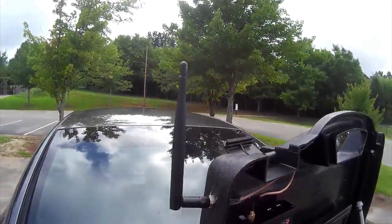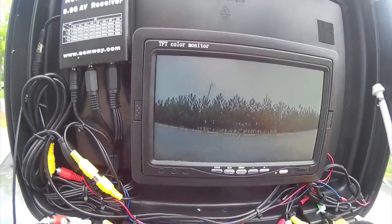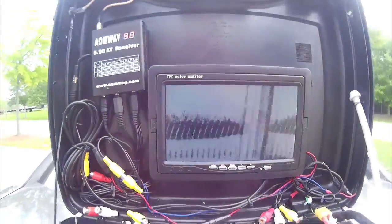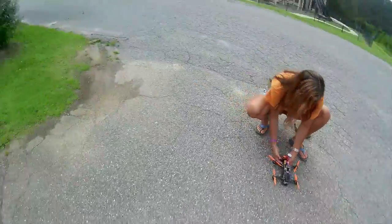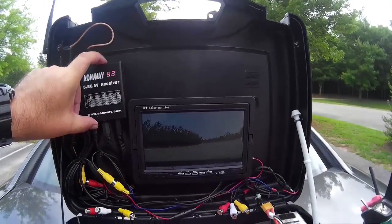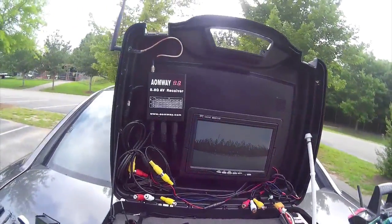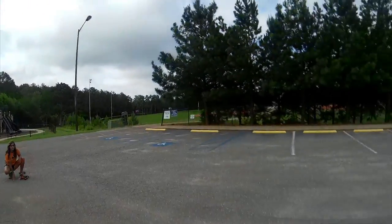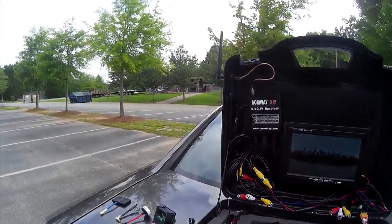There's the control test — there's my rubber ducky on channel 43, which is 5780. We can see the video from there. I'm going to go to channel 42, which is one channel below, and we're going to have Miss Vivian turn on this copter. And there it is, it's now turned on — we can see video from it. So channel 43 is the far quadcopter and channel 42 is the other one. OK, let's turn it off and start our test. Miss Vivian is going to fly right in front of me and we'll see what happens — if that causes me any problems.